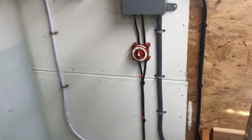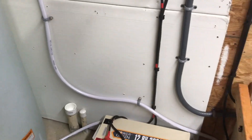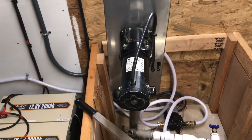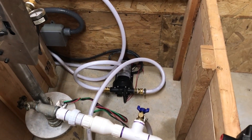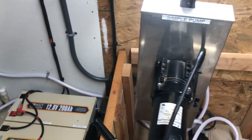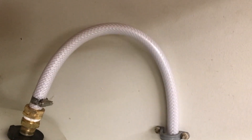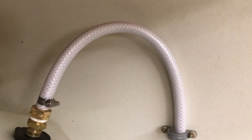You can run the garden hose setup like this — it's quick, easy, and down and dirty — or you can plumb it in with PVC or PEX. But you'll need some braided stainless steel fittings on your pumps because they're not solid mounted and can move. The way the simple pump pulses, you would need a braided stainless coupling to absorb the shock from the pump. As you can see it's moving, so braided stainless is required if you're doing rigid pipe.